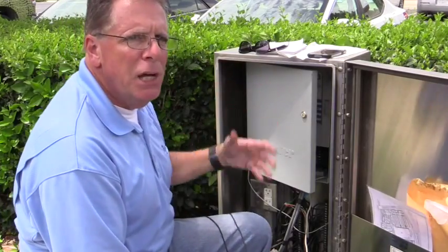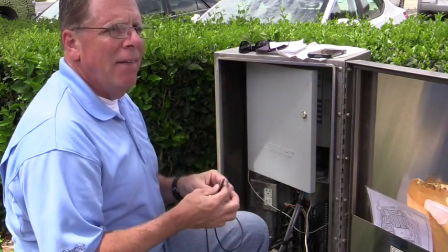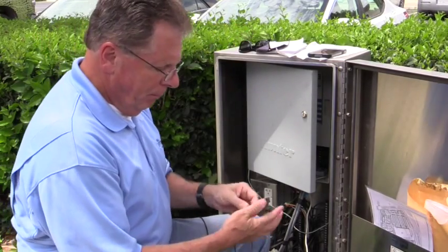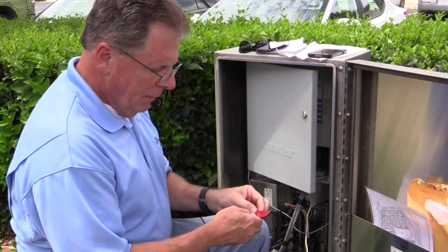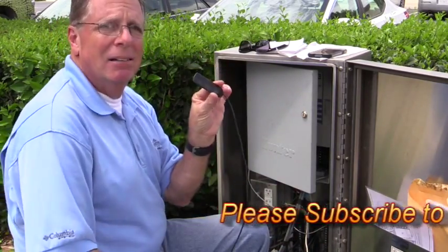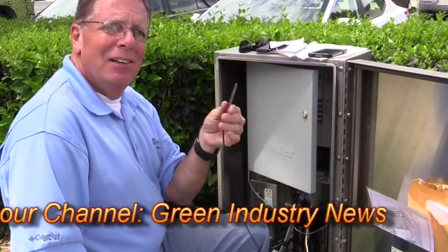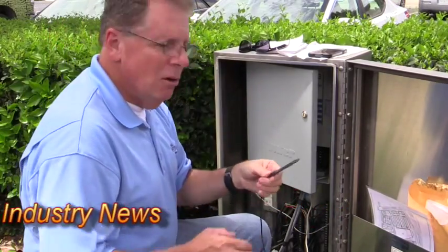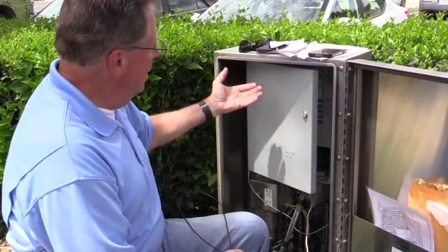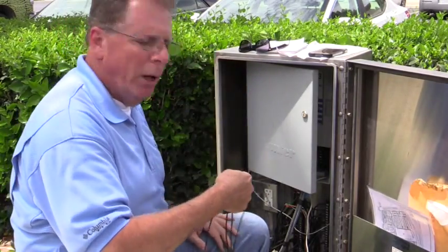If this were a more permanent commercial installation, they sell vandal-resistant pancake antennas and vandal-resistant high-gain antennas that can be mounted through the box itself. But for this demo install, I'm just going to use one of these. I got them online through Amazon for $7.10 each — you get 10 of them for $71. They don't increase the cell signal like a gain antenna, but if you just need to get the signal outside of the metal box, you can't get much less expensive than this.